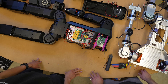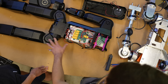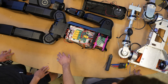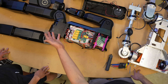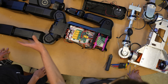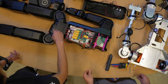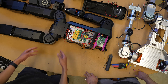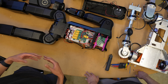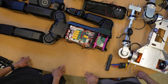With the arm and the side of the torso off, let's focus on the lower half, starting with the hip — our major 3 degree of freedom joint. Historically, a lot of humanoid developers do adduction before the flexion joint, whereas we do flexion before adduction. That gives benefits in terms of cost of transport — less weight being moved with the common forward-backward movement of the leg — but you do incur packaging and design trade-offs. We went for a flexion, abduction, rotation hip configuration because we wanted the back of the robot to be flat so it can lay flat or sit in a chair. This is very important for a consumer robot, since every interaction will start with the robot in those positions.